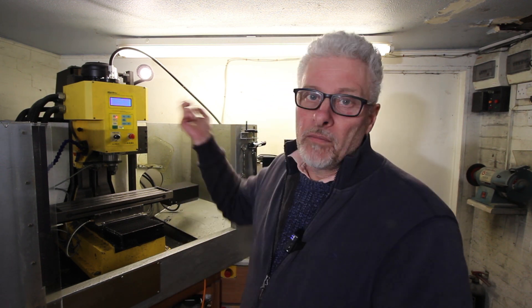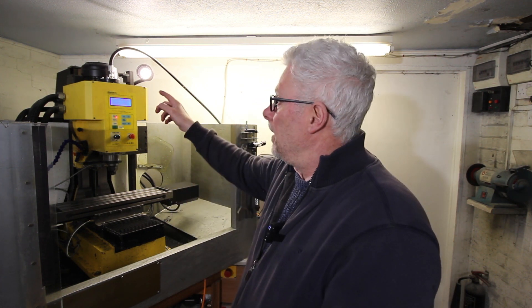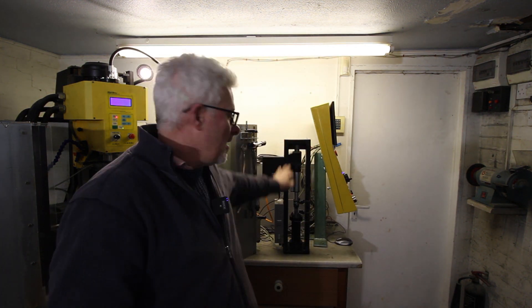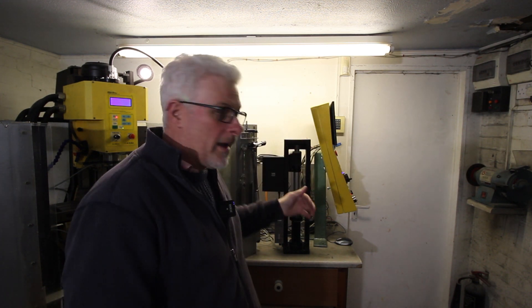Thanks for watching. Hopefully that explains it. I think that's a worthwhile project — it's taken forever to do, because of the various difficulties I've been having trying to get sufficient force to push the tool out. One and a half tons this thing can generate, which is phenomenal really. We've had umpteen different iterations. Those of you who've followed this series will have seen that I've tried four or five different methods of doing this. This, I think, is the most likely to give you success. It's also the easiest, I think. However, you do have to give up a certain amount of space, because you need some form of actuator outside or off the mill — you couldn't hang this amount of weight on the top of it. It'd just be a nonsensical thing to do.